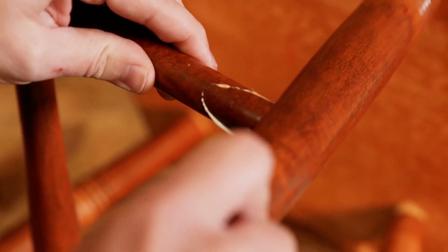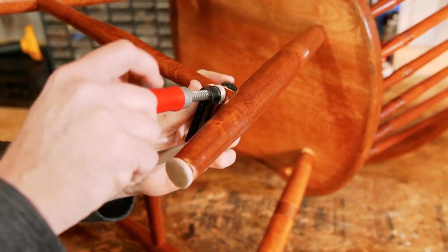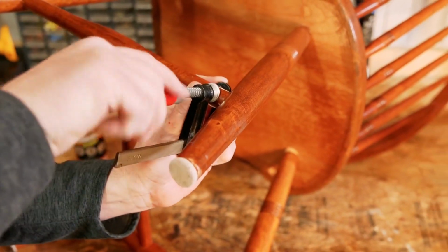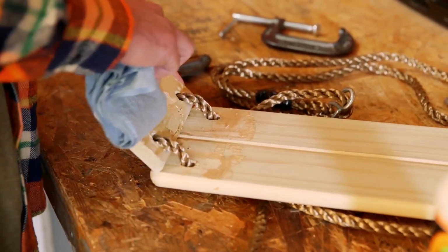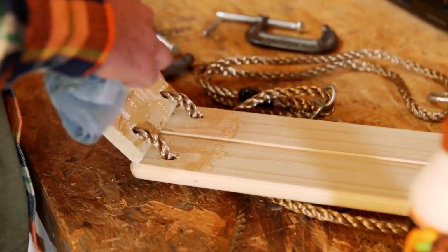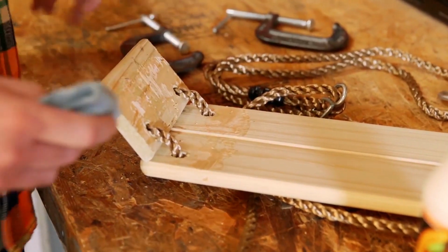Like our original wood glue, using Gorilla Wood Glue Ultimate is easy. But here are a couple tips to ensure your project lasts. First, ensure both surfaces you're gluing are wood. Wood glues, as you might imagine, are designed for wood-to-wood applications and won't provide the maximum bond on other surfaces. Next, shake well before use. Then clean and dry your surfaces to be bonded.